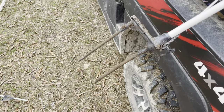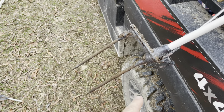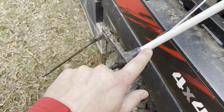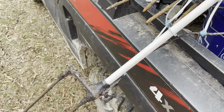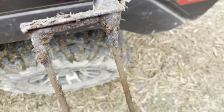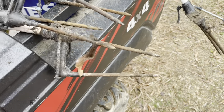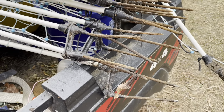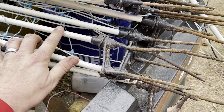A lot of different companies offer different things. Some of the posts just have a single spike on them, which are really hard to get in the ground, especially around here with a lot of rocks. This is a really rugged design and there's no metal in here, so there's no chance of the electric wire getting caught on metal and grounding out. One problem we have with these things — with the rocks in the ground — is that the spikes get bent up and I'm constantly having to bend them back together. But I don't think that's a Starkline problem; I think that's a double spike problem. The fiberglass poles have held up really well — we've had maybe two or three instances where these poles have broken.